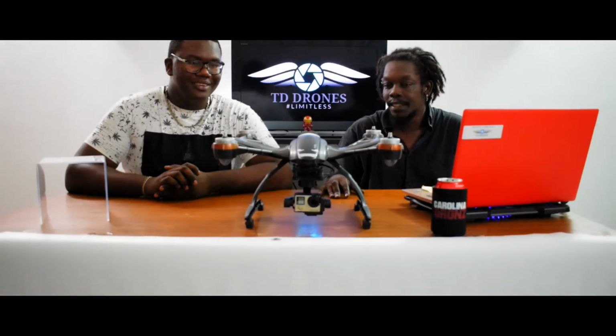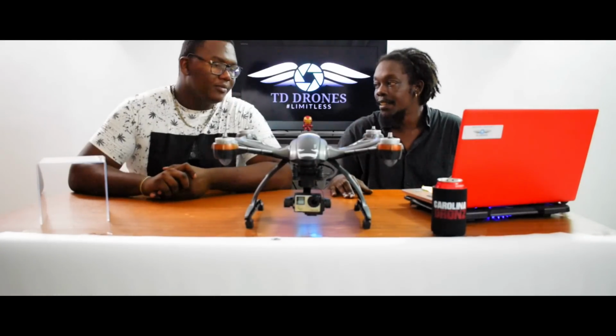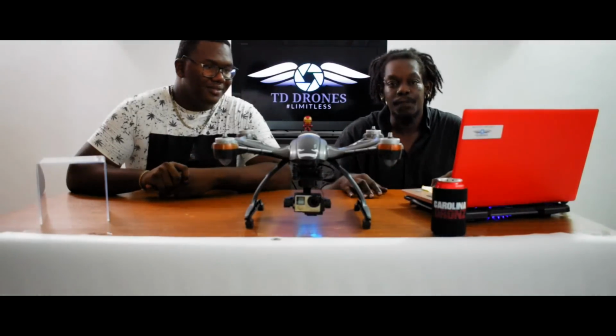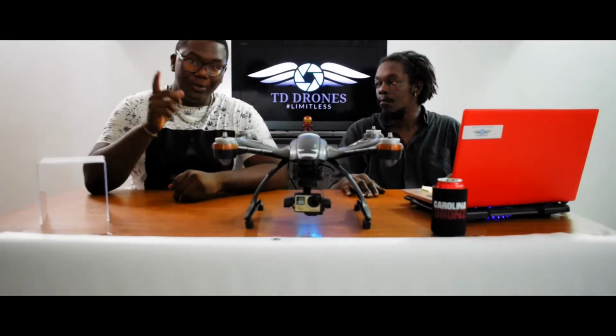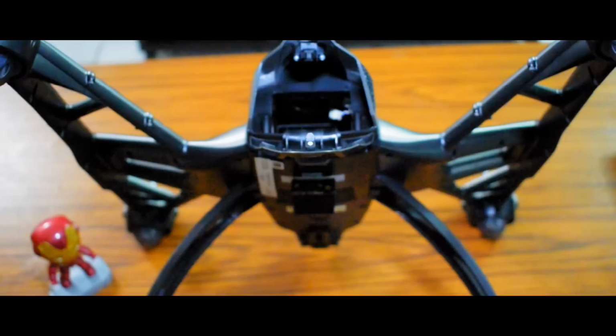And I'm gonna basically show you and everybody else how to change out the ESC and get your quadcopter back up and running if you happen to face any problems with the electronic speed controller. And we're gonna be doing it like this. To find out which motor is giving the problem, it takes a few steps. Right now, I'm just gonna go through a process and we're gonna start by finding out which ESC has to get changed and how to go about it.